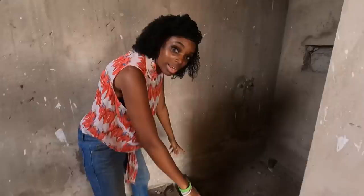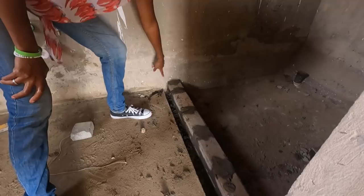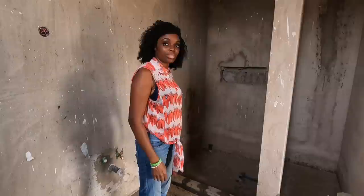But as you can see, if you haven't already spotted it, there is a small error in the gap here. You can see it's smaller here and it's bigger there, which means that something's not straight. And it's not the blockwork, it's the screed, basically. So they're going to fill this part in, right? Yeah. They're going to fill that in to make it one level so you won't notice it, but at the moment, obviously, it's pretty obvious. It's only by a little bit anyway, but you aren't going to get it perfect when you're doing screeding.